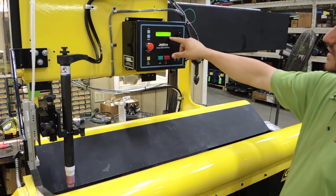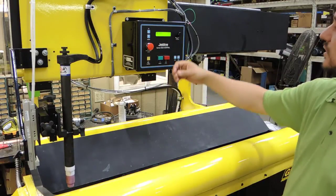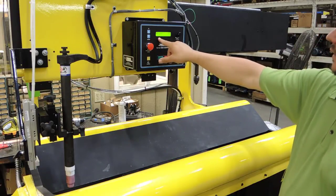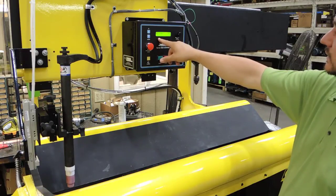Stop delay as well. Once the arc stop signal is sent, there is a delay in stopping the carriage. We have this set to one second. We currently have our weld timer off, and we're using our limits to control the distance traveled.